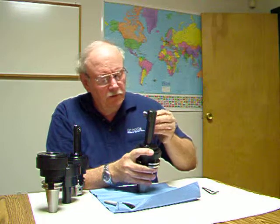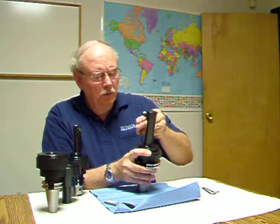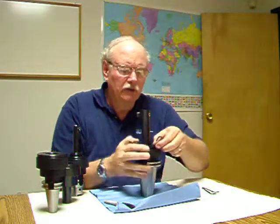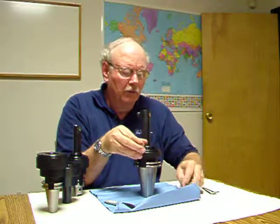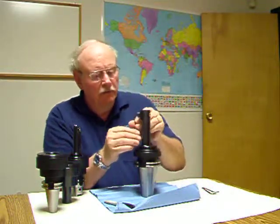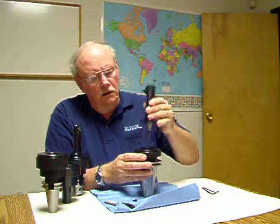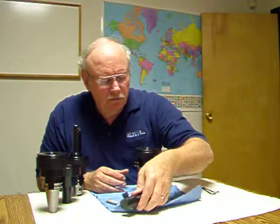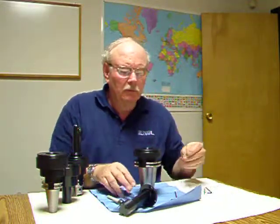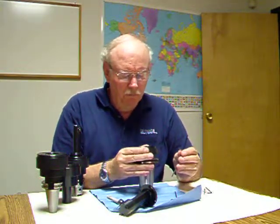This reaction ring is the thing that takes the most beating when the tool is running. We normally say at 1,000 PSI the reaction ring is going to last about 300 hours. You should check it at 250 or 300 hours, and if it's got pits, then it needs to be flipped. You can flip it and get another 300 hours, then replace it and rebuild the motor.